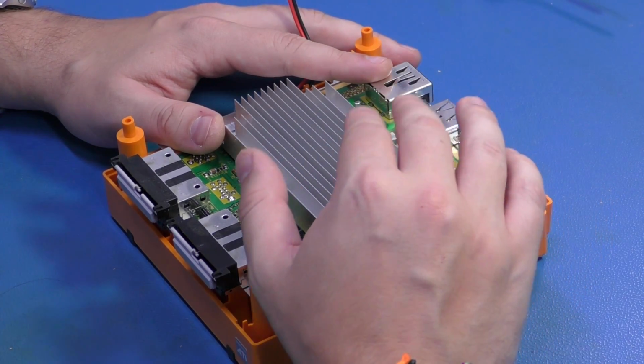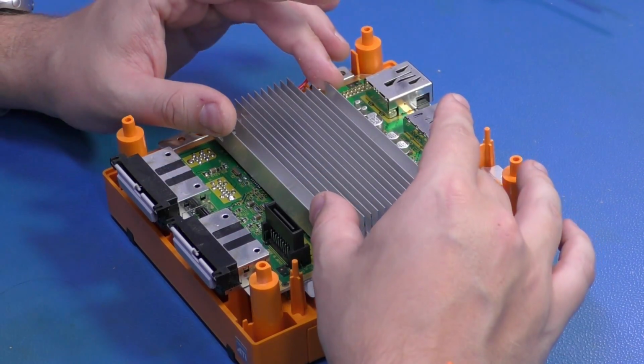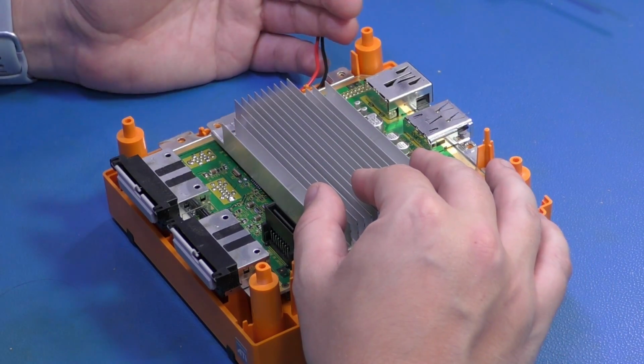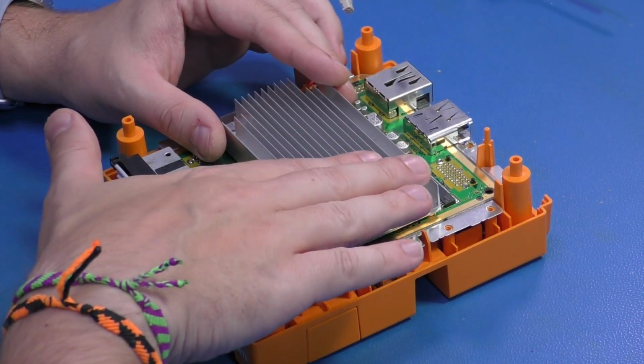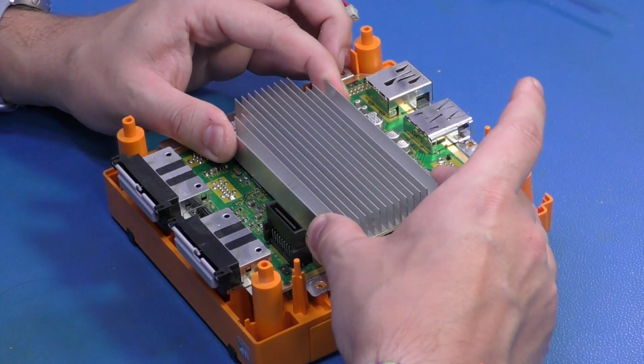Now I'm going to do about 100 degrees Celsius at around 50% airflow with my hot air rework station for about 25 seconds. If you have a hot air gun or a hair dryer, low heat for maybe 20-25 seconds, at a good distance from the heatsink. You just want to soften it up a bit, and this will come out like butter.